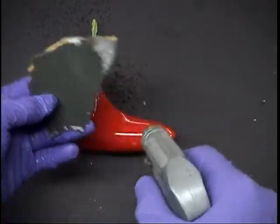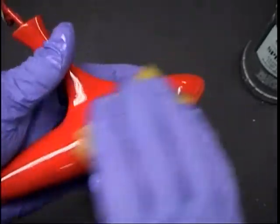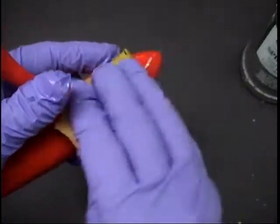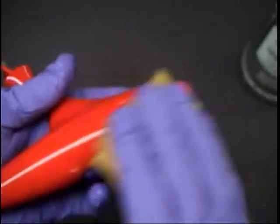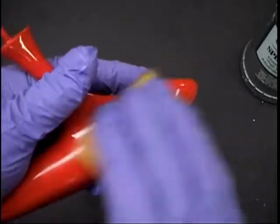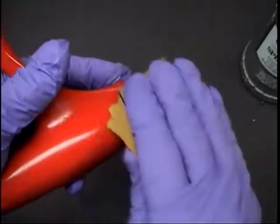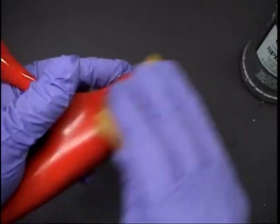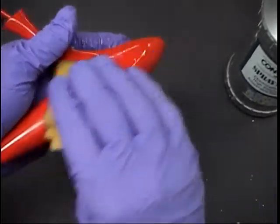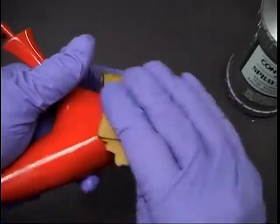Now thanks to Bobby Brookins, we do have a little bit of M600, and M600 of course is always the choice for a wet sanding. But if I pick a spot, and it doesn't matter, I always like to show, if you can let this dry an extra day, and we did, we went to the Sussex County Fair to see all the things that you see at our fairs, the cows, the chickens, some exotic stuff. But anyway, now this should be ready. The nice thing about the M600 is if you sand through a spot, you don't get all that puckering of the wood that you do with water or Windex or whatever.